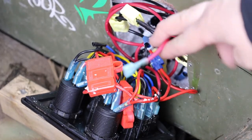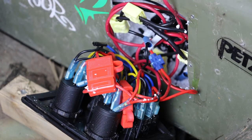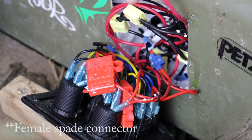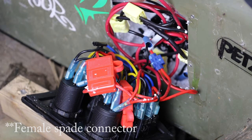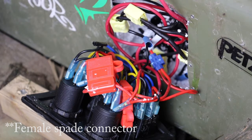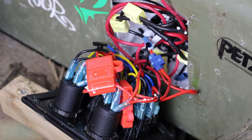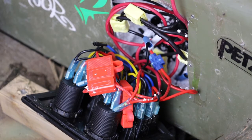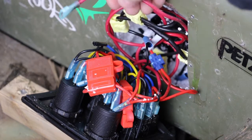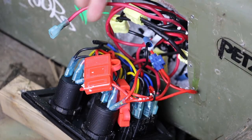Here's the back of the panel — it kind of looks like a mess. What we have are the power wires from everything: the lights, the bilge pump. Every set of lights has its own wire because we have four switches. They supply these little plugs with the rocker switch. Basically, all the power from each component — you just put one of these on, crimp it. Mine are all shrink-fit so they come tight to the wires. On the back of the rocker panel, every switch has an open connection, so on all the positives you plug these in.